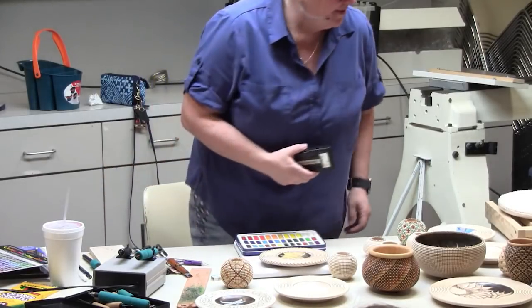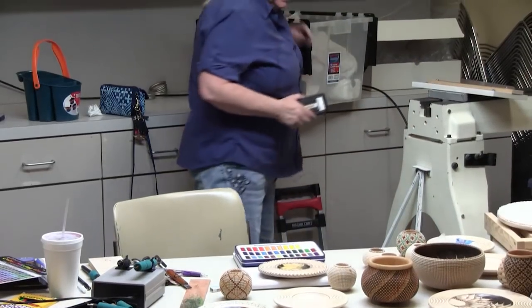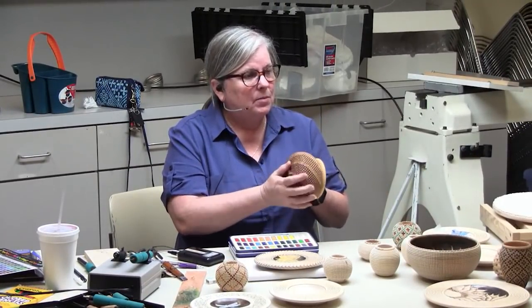It's Howard's — I think you can get it at Home Depot. I thought I brought it, but it looks like this: it's just a little bit more protective than the Krylon. If you put some of the wax out in a little cup or glass bowl and microwave it for about two or three seconds, it melts down and then you apply it and it filters in better.